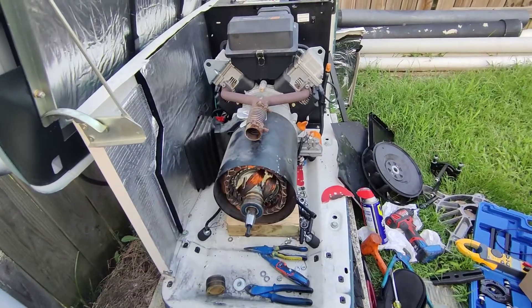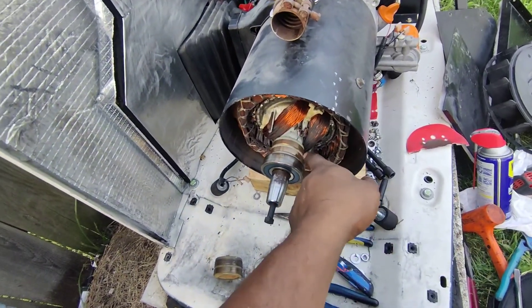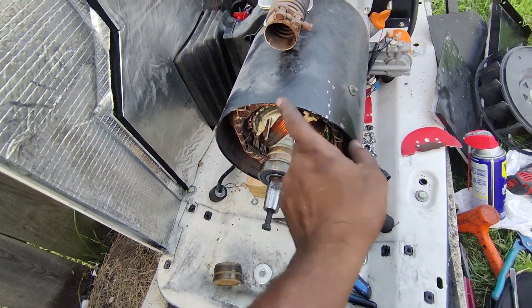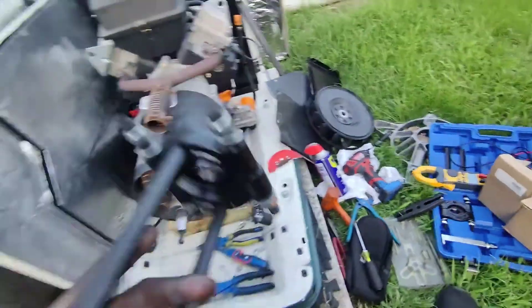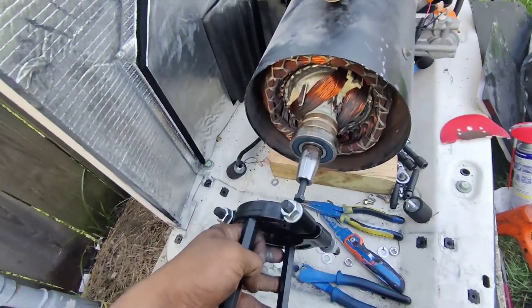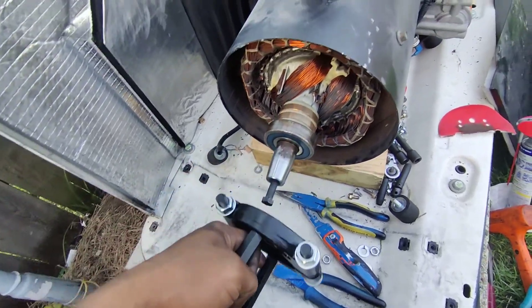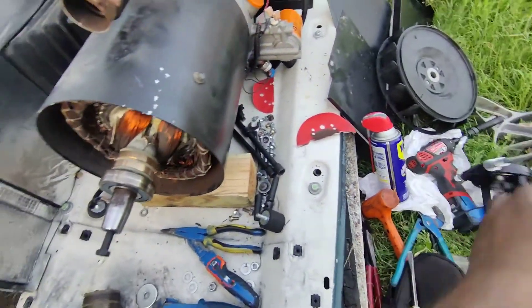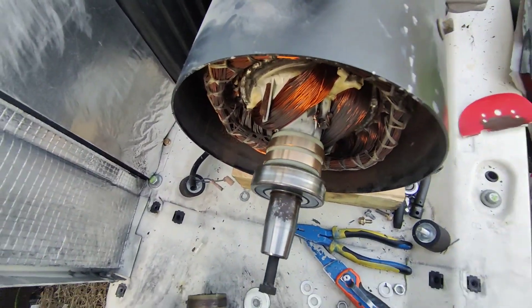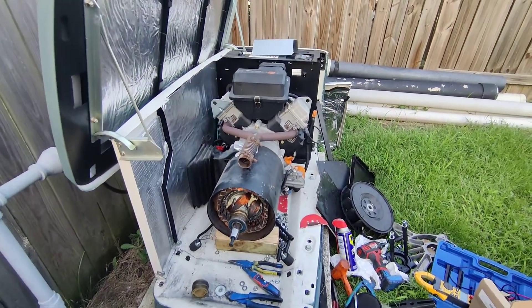Pretty straightforward. If anybody's got mechanical skills, you should be able to do this. The main thing is just don't damage the slip rings putting them back on. The way I put the slip ring back on is I used the bearing puller, set it on like that, and used my rubber mallet to beat it back on — beat the slip ring back on and beat the bearing back on, both in the same spot they came off. So yeah, this is how to fix the low-voltage alarm on a Generac generator.